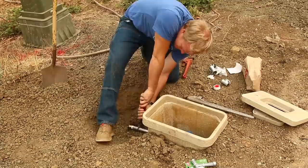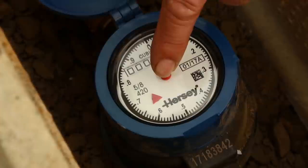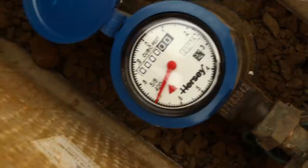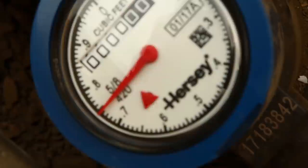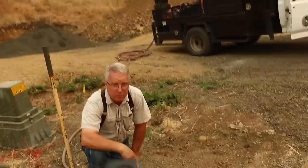It'll be really nice to have for washing off concrete tools and wheelbarrows, and for getting optimum moisture in the subgrade. If you wonder if you have a leak in your house — a slow leak, maybe water showing up under your subgrade or you hear dripping and can't find it — come out to your meter. If you've got one of those little triangles right there, that thing spins amazingly fast if there is any water at all escaping from the system. The actual numerals that determine your billing move ever so slowly, but that little triangular indicator spins like a top if there's even a drip — you'll be able to see it moving in real time.